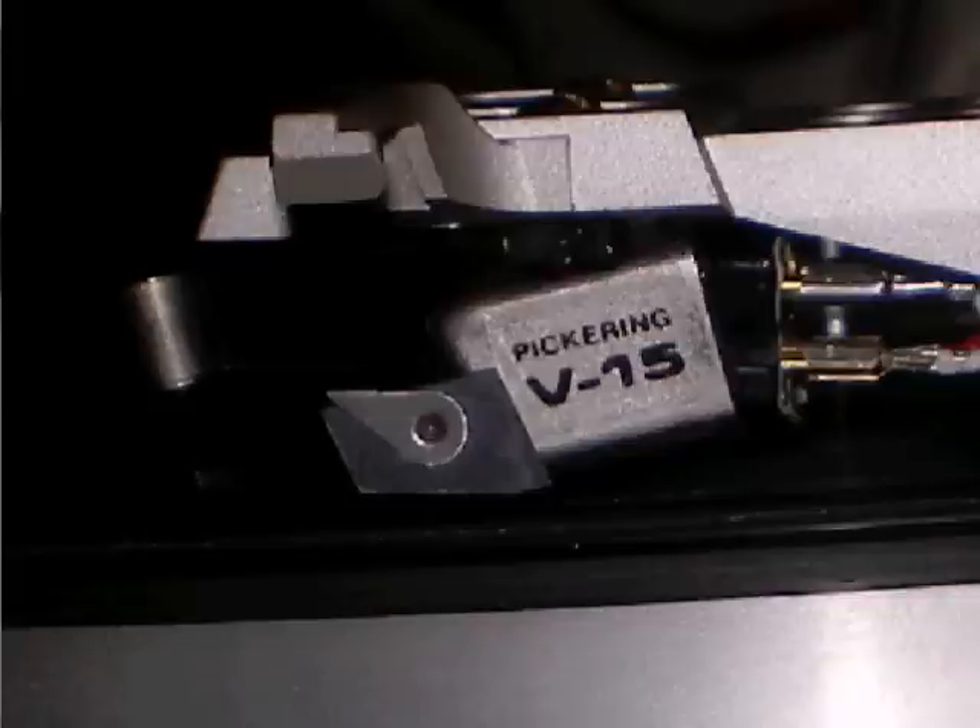On the audio boards I've read, people have kind of put down the audio of this cartridge, which I find interesting because to me it sounds great. It sounds as good as the cartridge I had 20 years ago. Comparing it to modern cartridges — the AT120E by Audio-Technica and the M97XE — the distortion is extremely low, and I especially like the way it handles vocals. Pickering cartridges have a little bump in the upper mid-range that really brings out clarity in vocals, cymbals, and saxophones. The frequency spread is very nice: great low-end bass with a lot of thump due to that high output, crisp yet silky smooth high-end, very little sibilance, and inner groove distortion is almost non-existent.